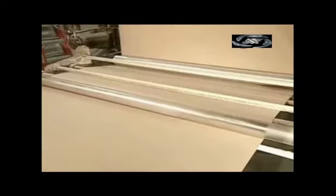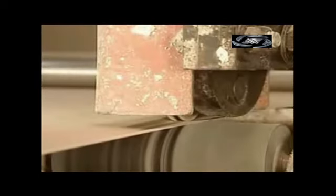The bread is this thick, heavyweight paper. As the roll unwinds, creaser wheels, as they're called, score a line just over 1 inch, about 3 centimeters, from both edges. Then a machine evenly spreads the slurry like a sandwich filling between the top and bottom sheets of paper. Next comes the paper folding operation.